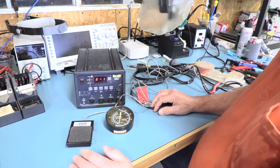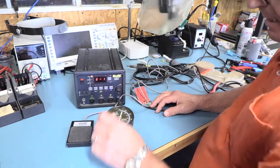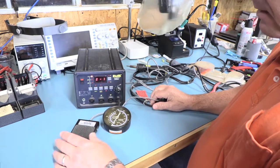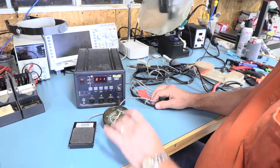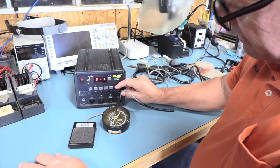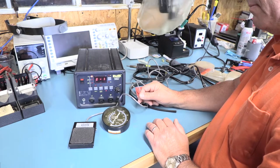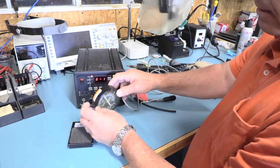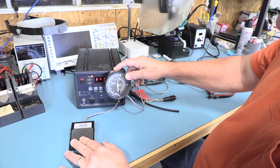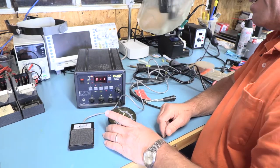Not much. This doesn't seem to do anything. I might have to find the manual or take it apart. Looking at this thing, if I had to guess: positive would be more air, negative would be less air, and maybe that's how it regulates the suction. As you can see — there we go — it's pulling about two inches of mercury. That's not a lot at all. Let's see what the output says — this thing should go positive. I'm guessing these air holes here probably have something to do with it.